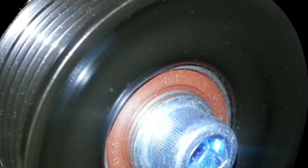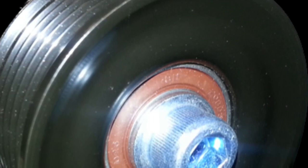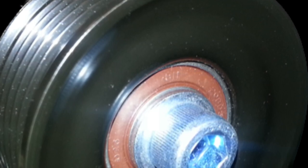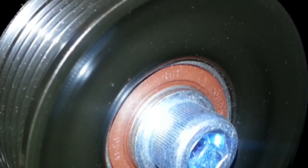We now also recommend that the crankshaft pulley, which is an aftermarket lightweight pulley, be replaced with the OEM Honda Fit steel pulley, like a 2012 Honda Fit, for increased service life out of the engine. Be sure that when this is done, the seal that is being installed matches both the rear cover and the Honda crankshaft pulley.